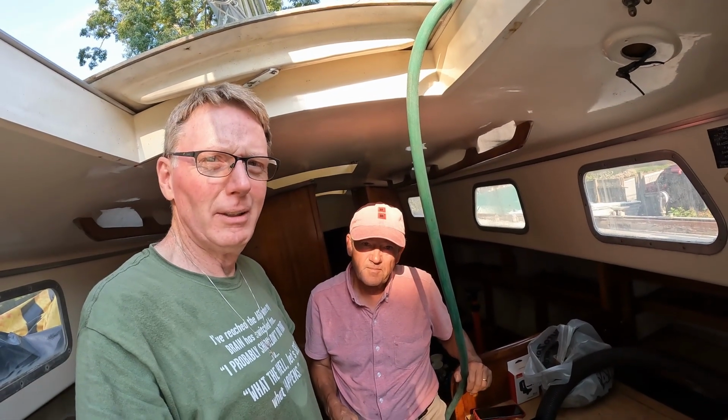Chuck's here with me. Hello. And we have put the batteries in the boat, we put the new ignition switch in, new fuel filter, we put fuel in the boat, we've opened the injectors, pumped the fuel through the injectors, so we think we're good to go to try to start the engine.